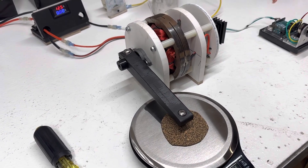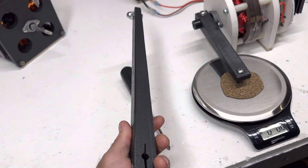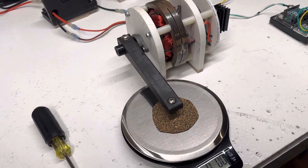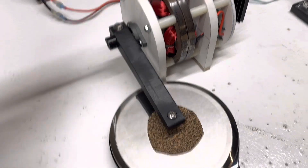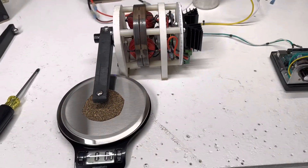I made a prony brake. This one is for quarter inch shafts. I made some for 5/16ths and I've got to make a couple more. This one is a foot long exactly, and this one is 6 inches exactly. How it works is you just tighten this up for more or less torque, and then we'll use the scale to compute the horsepower and torque.